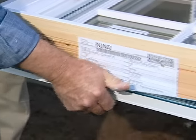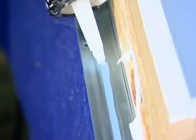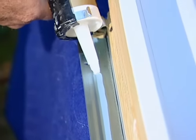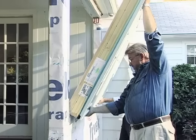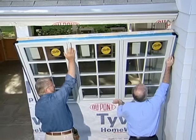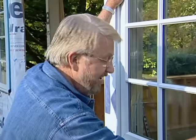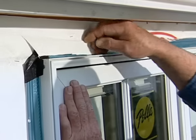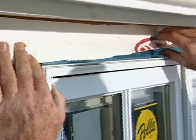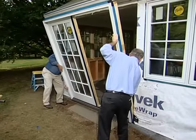My new windows come with a metal flange that must be bent outward so that it's perpendicular to the window frame. The weathertight seal comes from a bead of caulk applied to the inside of the flange. Installing these windows — at least the larger ones — is definitely a two-person job, so I recruit my neighbor Peter to lend me a hand. After setting the bottom of the window on the finished opening, we just tilt it up into position. At the top I make sure the house wrap laps over the flange, then nail the window in place.